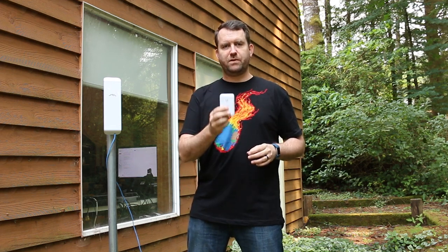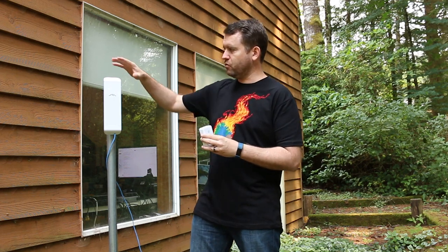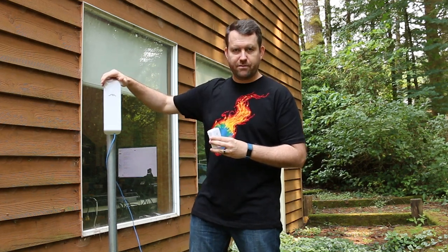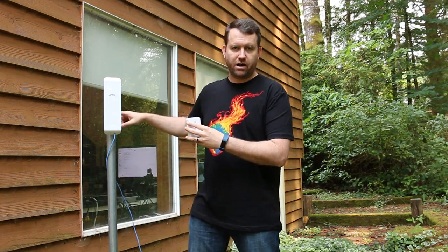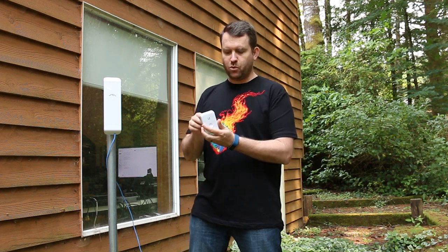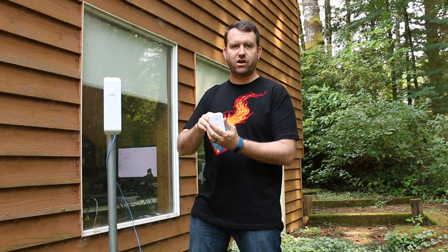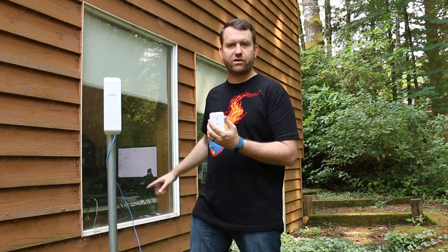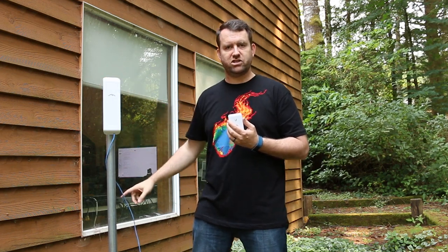In order to prevent that, we have the ETHSP, which is just a surge protector. We're going to run a line out from the M5 into the surge protector and then out from the surge protector into my office. This functions basically as an Ethernet pass-through with a ground, so that any electrical interference that comes through here grounds out instead of going through the wire. This device is going to get fried, of course, but it should protect anything connected to the other side.